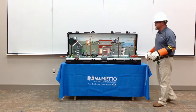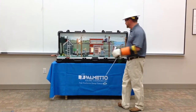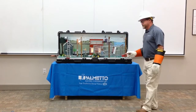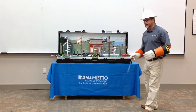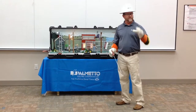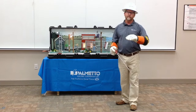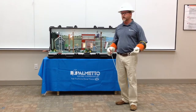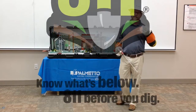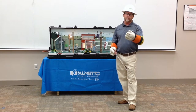I've been talking pretty much about overhead power lines. Now I'm going to switch over to underground. We have a tractor here, and somebody's wanting to dig, maybe put some plants around our equipment, that kind of thing. And we have stickers, we have signage that says, no digging, keep away, call for locates, that kind of thing. There's a number you call, I believe it's 811, that you call and get a digging certificate there, a locate certificate, a number there, and that covers you if anything goes wrong.